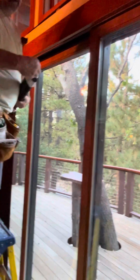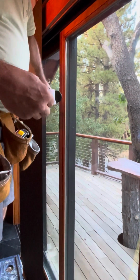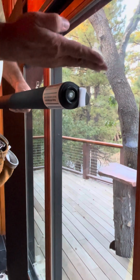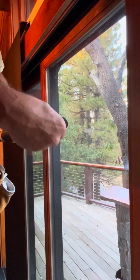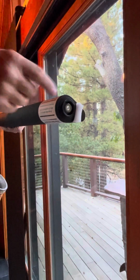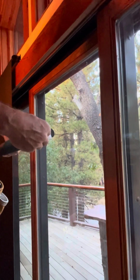And that's this guy here. So we turn this until it stops. So this turns inside here. If you don't turn it till it stops, the shade will flip over the top, because when you initially set up the shade, the first thing it's going to do is raise all the way up till it hits the hard upper limit. So you want to set it so that that hard upper limit is set. These can come unscrewed in shipping. So if it's loosened up like that, you'll set your shade, you'll press it, and then it'll flip all the way over the top, and you'll go, all right, you get to take that down and reset that. So set that till it's tight.